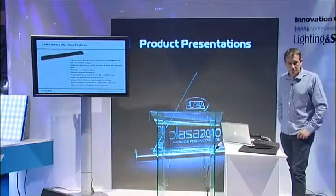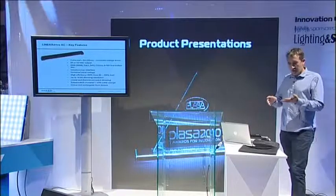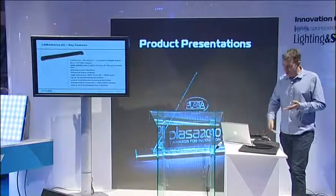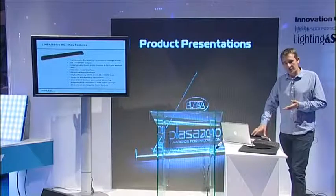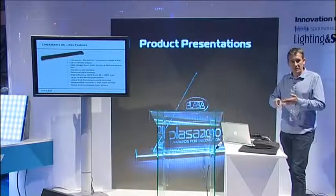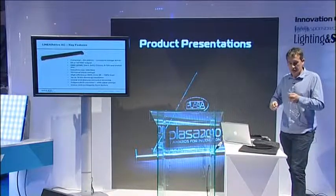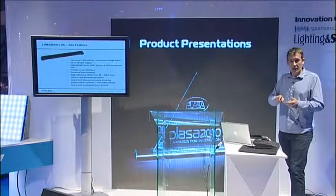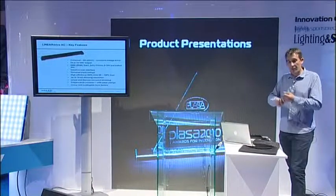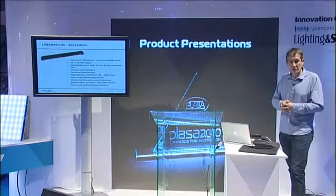Why do you feel that this product represents an innovative step over what's out there at the moment? Well, at the moment there's a vast array of LEDs coming to the market, and if you're a fixture manufacturer, you have to deal with most of the variables with LEDs incorporated in one drive unit. So at the moment, yes, you can get a driver that will drive 1,000 milliamp LEDs, but then if you want a different driver to do 350 milliamp, you've got to buy yet another product. You can have a 1 to 10 volt control input, but then you'll have another version with a DMX control input. So this driver addresses all available output current options and most available common control input options in one unit. So it's incredibly flexible.